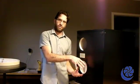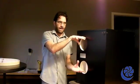So from the house, the air gets taken into the return, first past the duct where the return of the RecoupAerator would be connected. So the air would get sucked out of that duct and thrown outside, some of it. And then you would be getting fresh air from the RecoupAerator also injected back into that same duct. Now, the catch with that installation is that you want to run the RecoupAerator with the forced air fan. Because you can see, if you're not running the forced air fan and you have both of these ducts connected to the same trunk line, they're just going to recirculate. It will be ventilating that little section of duct very well.